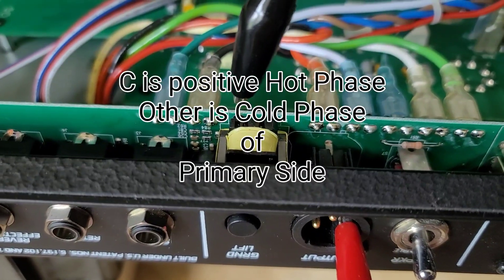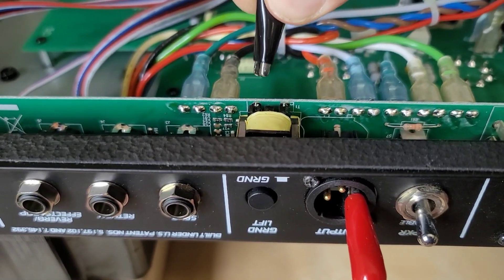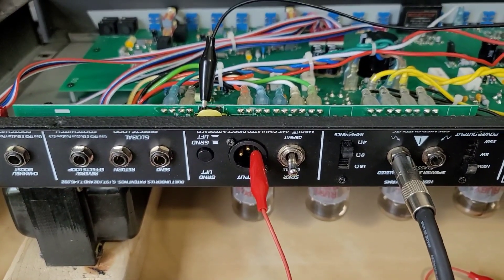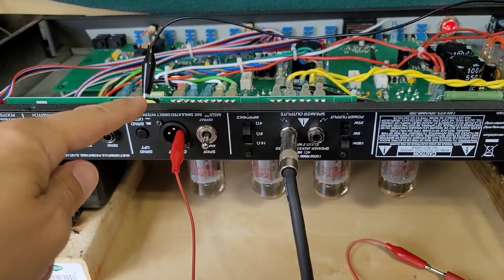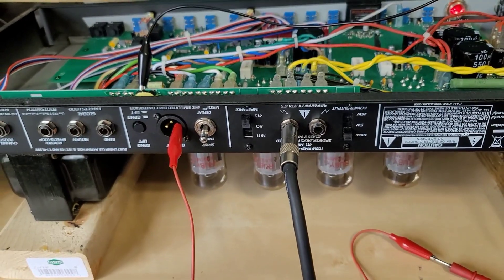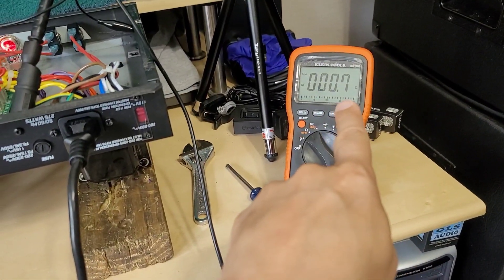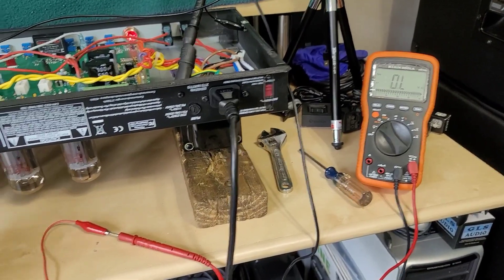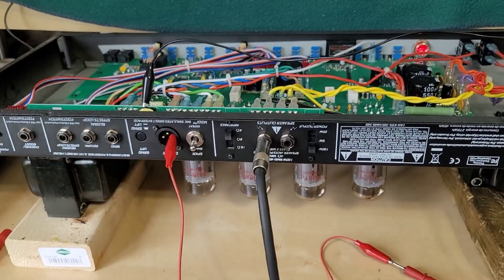The positive connection goes straight to pin one. Because we have that nine kilo-ohm resistance, if I short that to chassis ground, it goes away. So the solution is simply to connect that lead to chassis ground. We're going to run a very short jumper wire to one of the mounting screws here — to one of the switches that has continuity to chassis ground — and that's it. Now it's silent as can be, and you can see that it is a very low ohm potential. I can disable this by pressing the ground lift switch, and that's exactly what it should do.